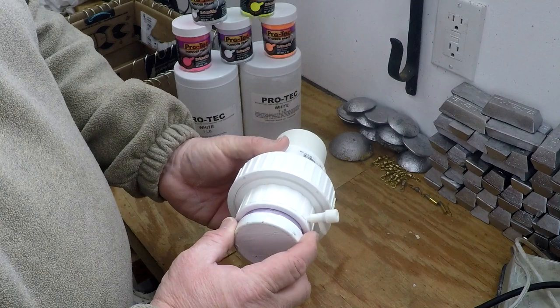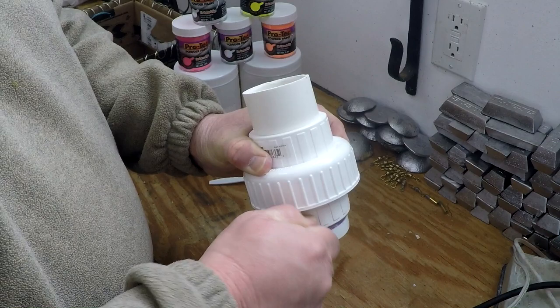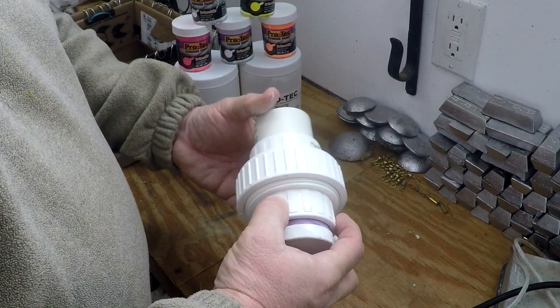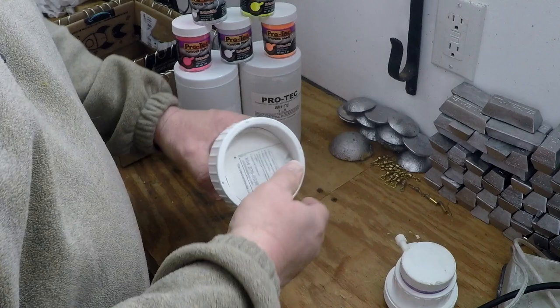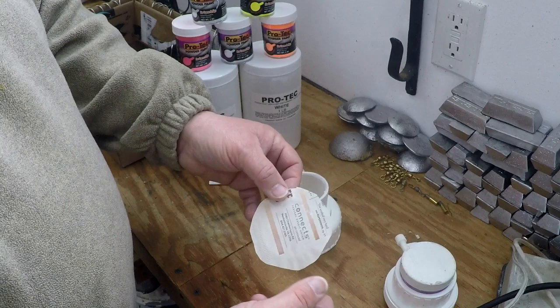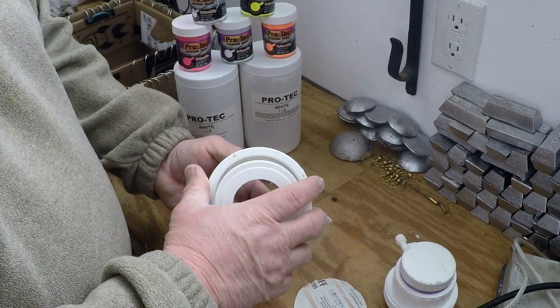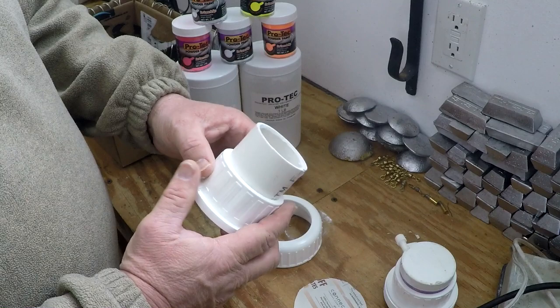All I've done here is take a short piece of PVC pipe with a little cap and put it on the bottom of a coupling. I've used an air fitting for a fish aquarium pump inside - just drill a little hole and it literally sticks in the hole. It has a nice little knob to control your volume of air, which is very important because too much air and all the paint will just volcano out of this thing. Inside the coupling, just as important, is an air diffuser. I've tried all kinds of things as an air diffuser - coffee filters, paper bags, regular notebook paper - but somehow newsprint seems to be the best thing for fluffing up that paint. The top half is just another short piece of PVC pipe glued in place, deep enough for your paint and for your jig to fit all the way in.